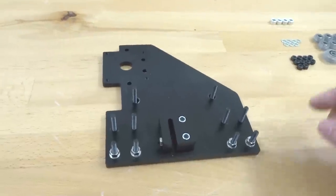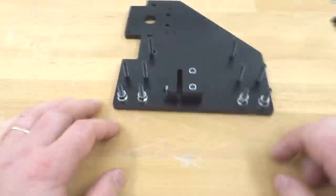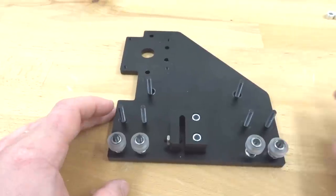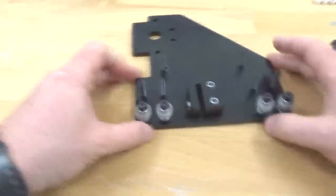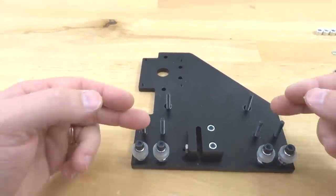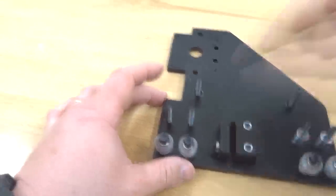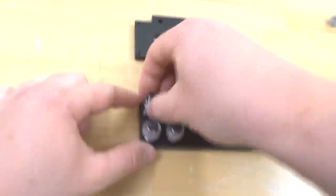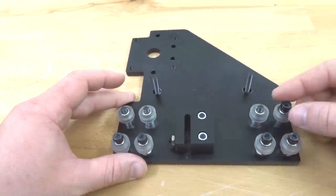In addition to the eccentrics, add our mini V precision shims on top of them. Following the precision shims, add our mini V extreme wheels on top of each screw, followed by our black nylon hex nuts. Moving on to the top side for our fixed wheels, start with our 6 millimeter aluminum spacers on all the screws, then our mini V precision shims. Add our mini V extreme wheels and our black nylon hex nuts on top and thread those into place.